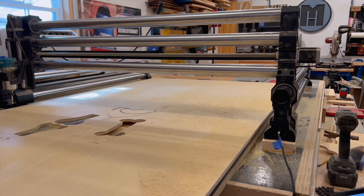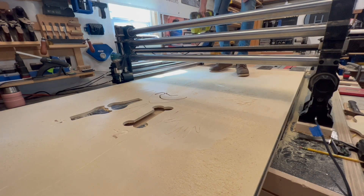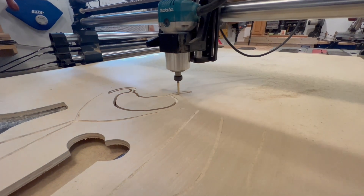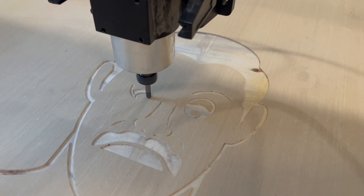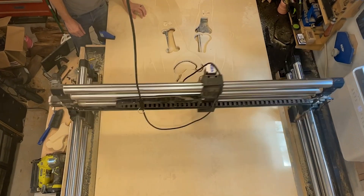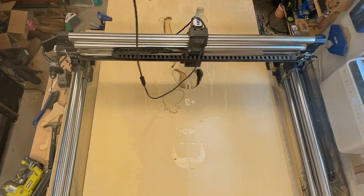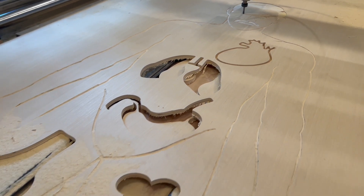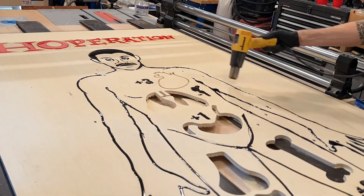Now I just got to move this sheet down exactly 48 inches to run the second tile, making sure to keep this left edge tight to the fence I set up. After removing the sheet, I secured it back down and ran the toolpath for the second tile — those file names start with T2. The first toolpath finishes up the body outline engraving and the organ hole cutouts. Then I just got to run the pocket toolpath for that super clever logo and we're all done. I'm pretty pleased with how well everything lined up from one tile to the next. After that, I just poured some epoxy into the engraved parts, sanded everything flush, and did all the stuff to make it a cornhole board. I didn't film that part because this video is not about making a cornhole board — it's about tiling, and I think we pretty well covered that.